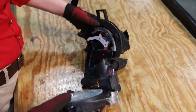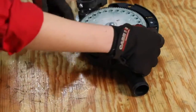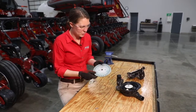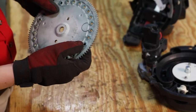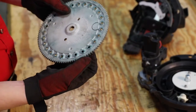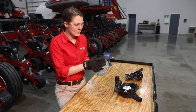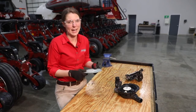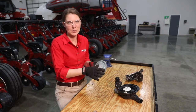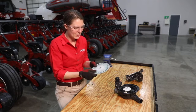On the vacuum side of our meter cover, the first thing we are going to look at is our seed disc and the wear on that. Key maintenance items on the seed disc: first, we want to check that the cells have maintained their shape and haven't egged out. We also want to check that the cells are still raised and still have a flat top, because these raised flat cells do provide agitation. If we feel we're lacking agitation in our seed meter, that's a good thing to check — are these cells still raised.